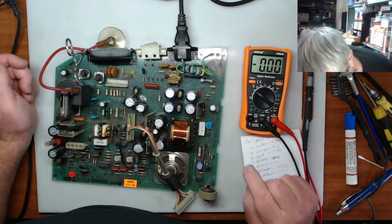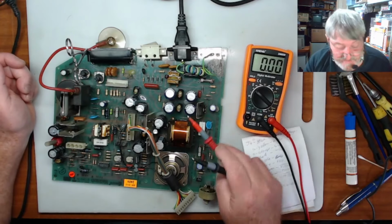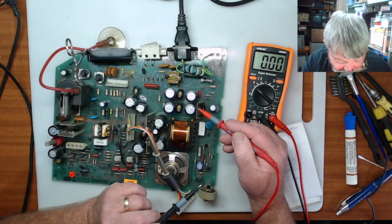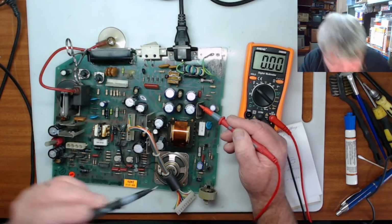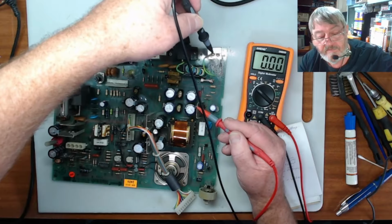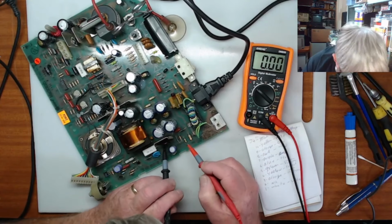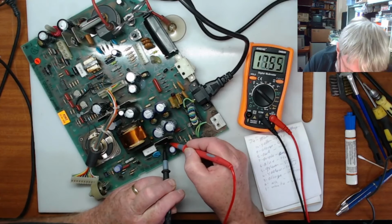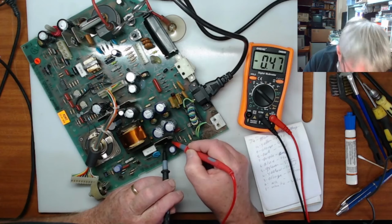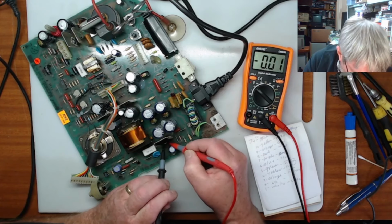So what we need to do is to check the voltages across this SCR. Now, this is where you've got to be careful. Some of the stuff is actually hot. So, this stuff would be live. And find ourselves an earth. Okay. And what I'll do is, yeah, 17, 16. It's not too bad in voltage, it's dropping away. 11, so the voltages are dropping down, so it's discharging.